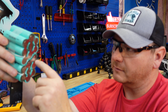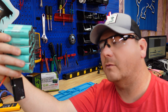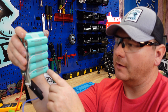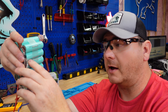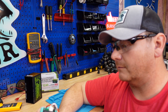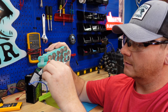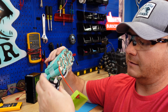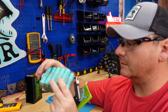I wish they had some fish paper going right between these series cells — that's becoming a common thing I don't see. The balance leads are touching the cells and I do not like that. I'd like to see fish paper around this pack with the balance leads run over it. The balance leads are actually positive underneath the shrink wrap, and right there is negative. You already have a BMS that's floating around, so things are going to rub and potentially short out.